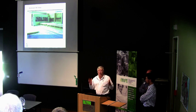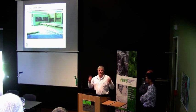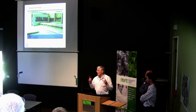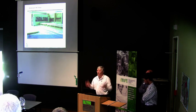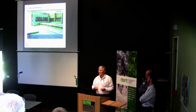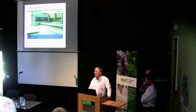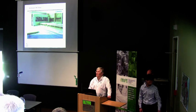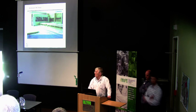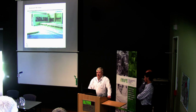The idea is to make the panels as big as you can. Timber is relatively light — about a fifth of the mass of concrete — so you can lift quite large panels on the same crane. It doesn't take any longer to lift a panel 15 metres long than one 5 metres long. Cranes are expensive and take time on site, and every panel placed means joints to deal with. Airtightness is something we want to achieve, so the bigger the panels you put in, the faster it goes, the less work on site, and the better the job.